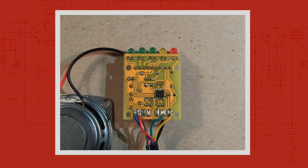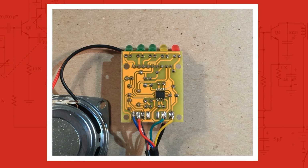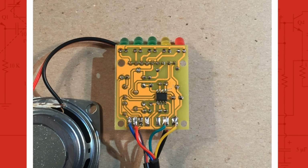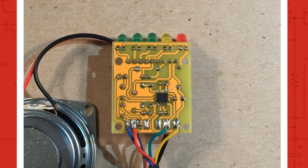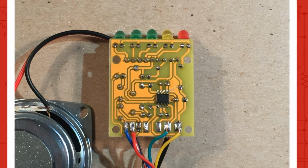In this last picture, note the red wire position. If you followed the PDF file, it would not work properly. You'd only have one channel. If you put the red wire as you see in the picture, you will have stereo audio. That's what you want. All right, let's go to the desk here.